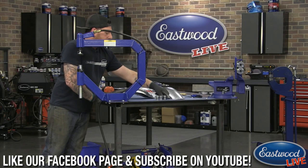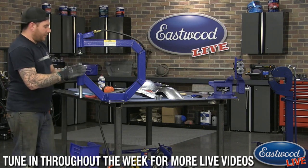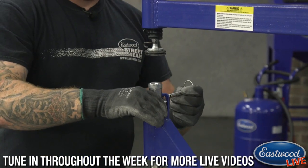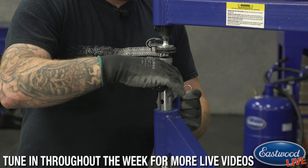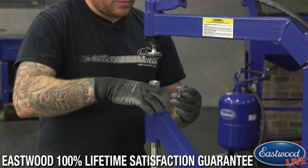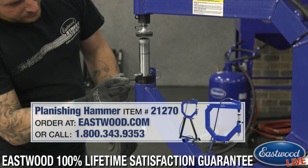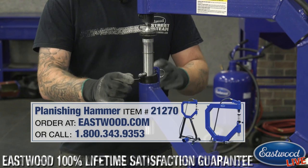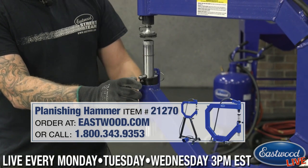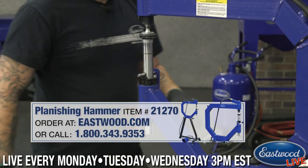So I'm going to pick the one that has the most radius here. We have a number one, a number two, and a number three. I'm going to use the number one. It's the steepest one that we offer. So we'll throw that in. This has a little quick release here on the planishing hammer to let you get your piece in and out. So I'm going to turn it up when we want to put the piece in and work it.